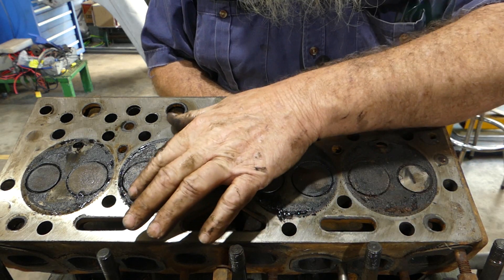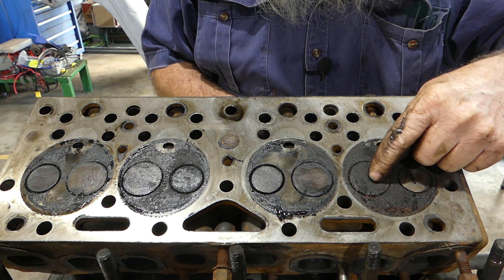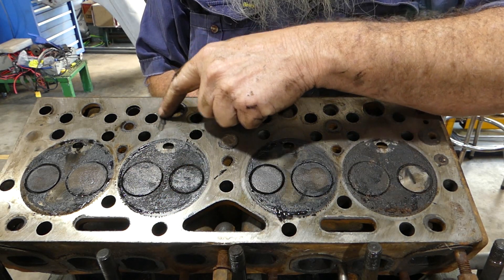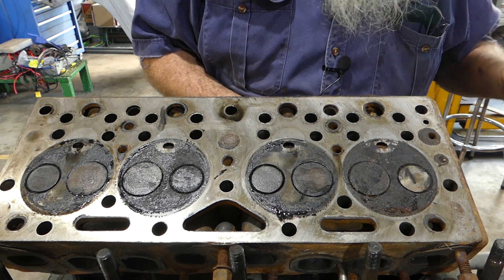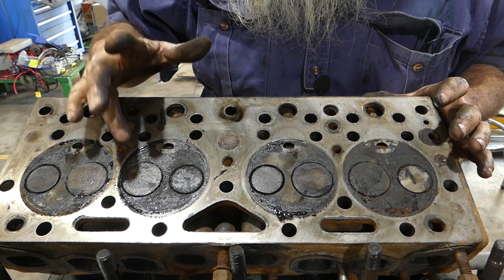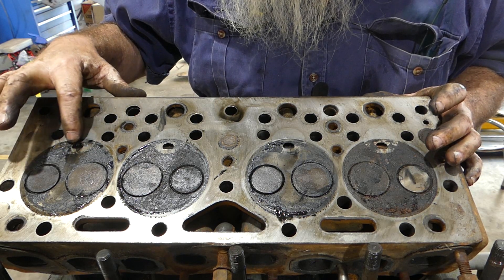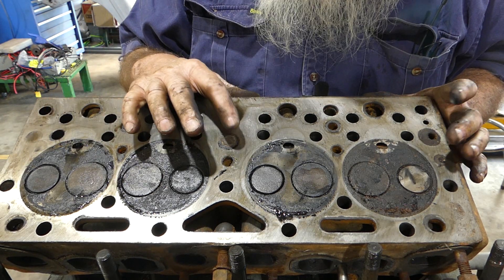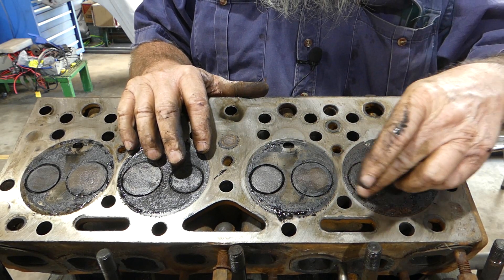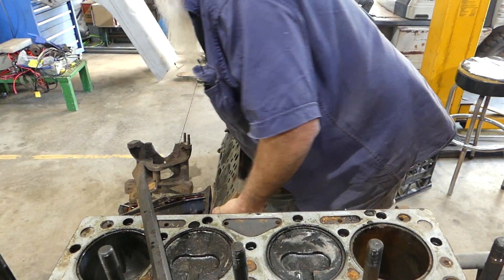When you run your finger over the inlet valves and check the height, this one is higher — I believe the tractor has sat with this valve open a little bit in the past. You can see a little bit of burn around here from where the injector had a bit of a squirt. But there's a lovely machining job on the head. In between the cylinders there's no blow-through from a worn head gasket at all. The pre-combustion chambers are here — you can just see the little circles. I think it's a good head and popping it apart, cleaning and lapping it, we may get away with using it on another project.